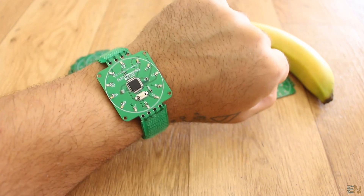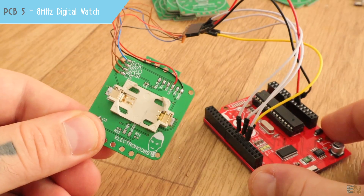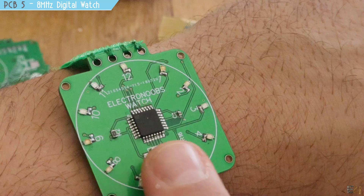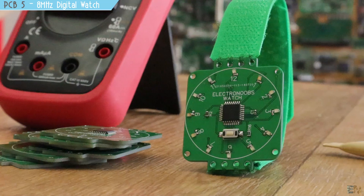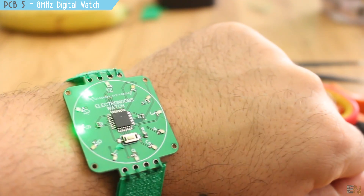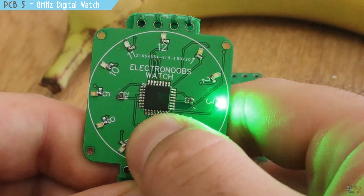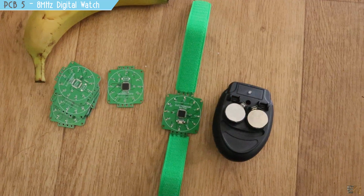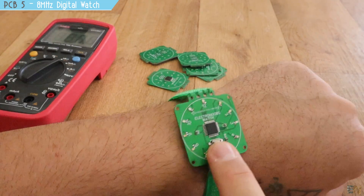Now let's see number 5. This was a simple project, but the purpose was to learn how to use the bootloader for the internal 8MHz clock of the Atmega328, how to use interruptions, and very low power mode to save battery life. This is a digital watch that uses LEDs to show the time with a resolution of 5 minutes. One push button lets you set and display the time. It runs on a rechargeable button battery and can last around 2 days in low power mode. It's not something you'd wear every day, but it teaches a lot about Arduino programming.